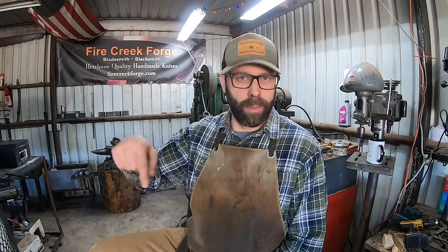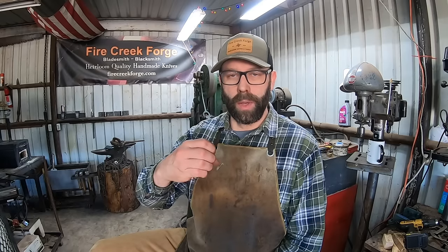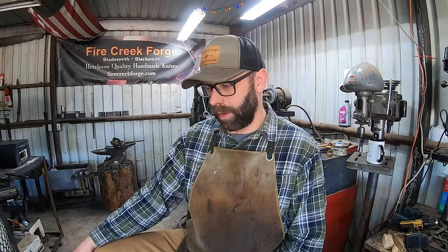So once you've heated it up, I like to set it with a hammer in this case. You're just gonna hammer a pattern so that everything is covered, and you can start up the middle to squeeze out any flux to the outside and then work your way down each side. And a couple, two or three times, maybe four times at a welding heat to cover the surface area of your billet by hand with your hammer is a pretty good rule of thumb.